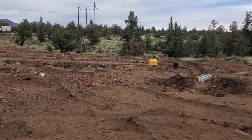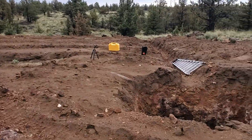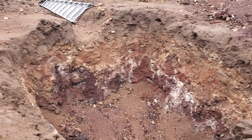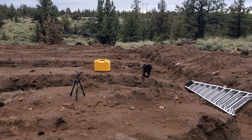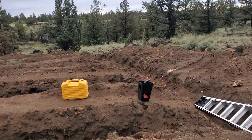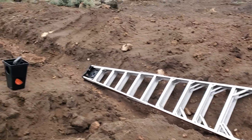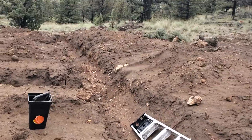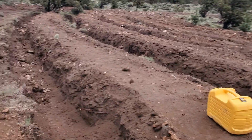Go down here, get the laser set up, crawl down into this hole for the septic tank and do some hand work — get it fine graded. I got the jumping jack from work, so get some compaction going in there. Then I got a drop box here today so I can start grading out basically the drain lines. I've got five drop boxes to put in down this line and those branch off to the drain field lines.